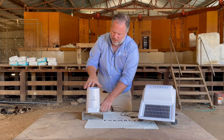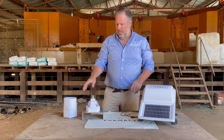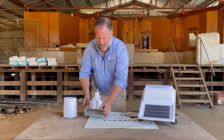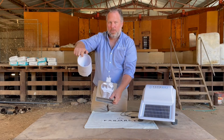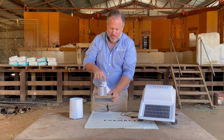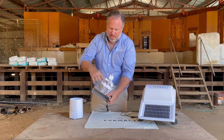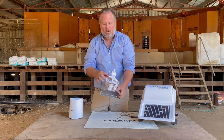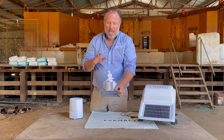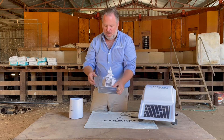The unit itself is very straightforward. It's not a completely set-and-forget product, because although it is self-emptying, the water is captured through the lid and funneled down onto a tipper like this. Three tips is one millimetre, and once it falls off the tipper it falls through these drawers and empties itself. So in that respect, you don't need to actually empty it and check the water itself.